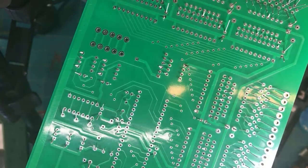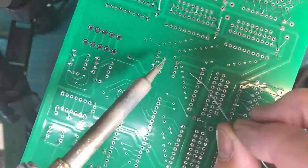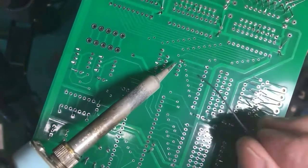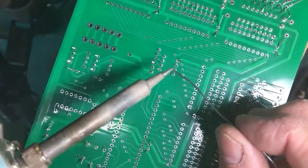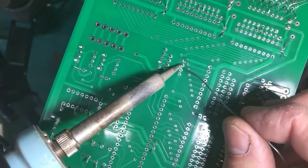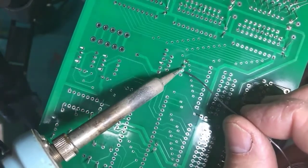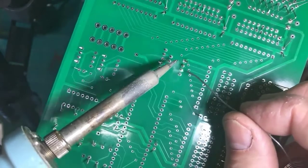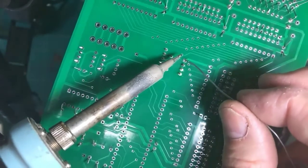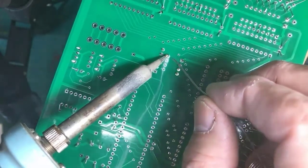So I can see that I'm putting the right amount of solder, not too little, not too much. Here we go. I'll try not to shade the work here. Wet the tip. Okay. Apply it to the work, pressing on the lead and the pad. Apply solder. Lead and pad. Apply solder. Notice I'm not staying on there long, because now that I can look at it and see what's happening, I can see that I've made a successful joint and I can get out of Dodge.